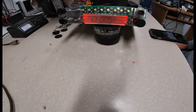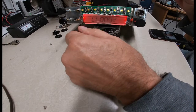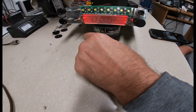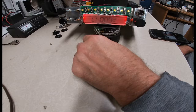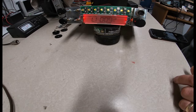Very interesting. So yeah, it must be keeping the charging circuit open enough that it's waiting for the charge, but instead it's discharging the capacitor. But when you either turn it off or remove power, it immediately shuts down that circuit so the capacitor holds its energy for an undetermined period of time. All right, well, that's kind of solved one problem. Anyhow, back to it. Let me stick it back the way it was and order some caps.